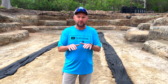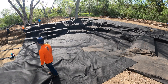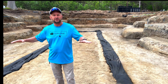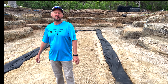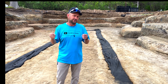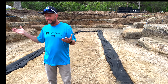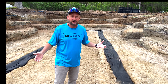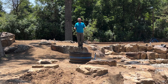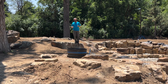Simple corrugated pipe wrapped up in underlayment. We're now going to come in here, put a rock pad in the bottom because we have some massive boulders going in the swim pond — that gives us a double layer of protection. Then in goes the liner, everything built on top. If that pipe stays dry, you never have to put a sump pump in it. If there's ever a problem, you have basically an insurance policy that you can't come install later. So thanks for tuning in to the Water Feature Design Series. I hope you learned a lot about how to put a proper drainage system underneath a water feature.